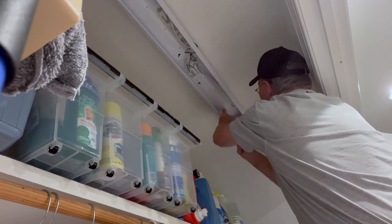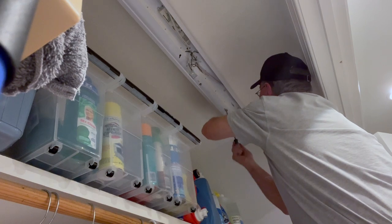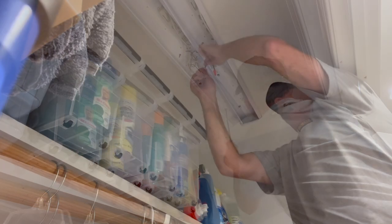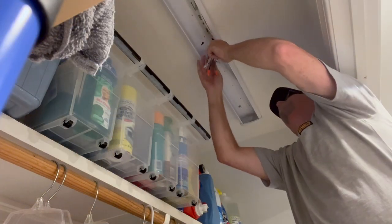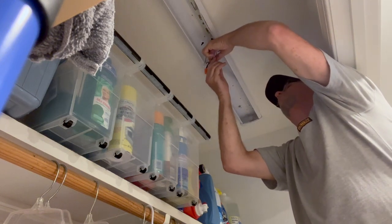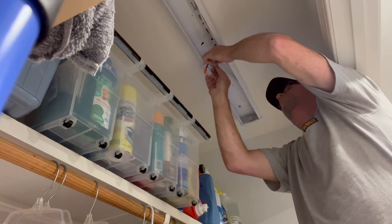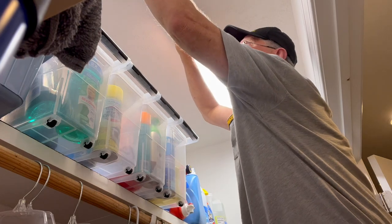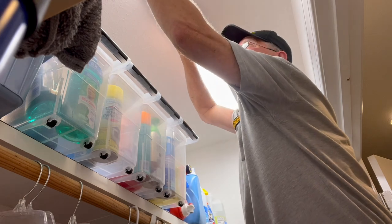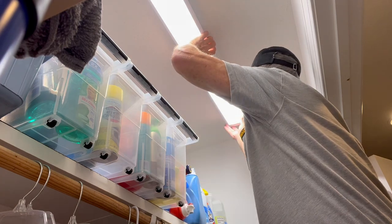At this point I am mounting it to the ceiling, just hooking it into the sheetrock using screw-in sheetrock mounts — they hold anywhere from 30 to 60 pounds depending on what size you get. Once I did that, it's just a matter of connecting the wires. This is very straightforward: connect black to black, white to white, and green to copper. Once I got that finished and got everything locked into place, I tested it — it was all working fine. Then it was just a matter of putting the final cover on, using both hands to get it in place, and once that locked in, I was all done.